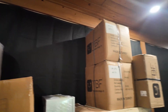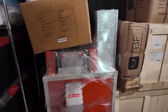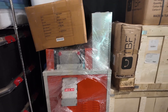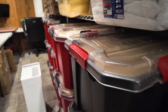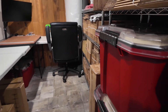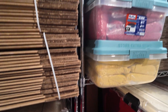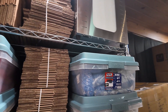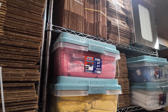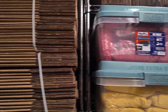Over here is an extrusion line that I have not unboxed or set up yet, as well as a pelletizer — I'll get into all of this in future videos. Here's also the raw PLA that I mentioned in a previous video — I believe it was 1,600 or 1,800 kilograms that I purchased, it comes on a pallet. Here is the masterbatch: I've got the primary colors so I can mix them together to make other colors — black, yellow, red, blue, and white. I think it's around three percent or less that you need for the masterbatch, and it changes per color.